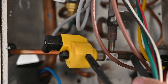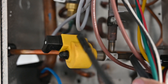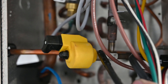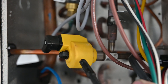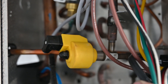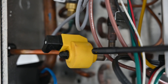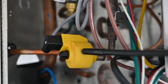This is our electronic expansion valve — and really it's misleading because all it really is is a step motor connected to a valve. This right here is a motor and it has many different steps, or positions. So this can open fully or close fully like a solenoid, but really there's going to be a control board and it opens and closes however many steps it needs to maintain the control of refrigerant into the evaporator. Our liquid line is going to be feeding it liquid refrigerant on one side, and on the other side we go through a distributor where we distribute the refrigerant to multiple locations. And it's a step motor because it has multiple steps in place — some people ask why it's called a step motor, and I like to say because it never knew its real motor.